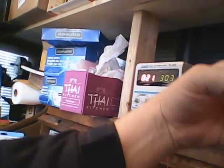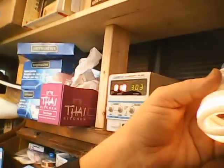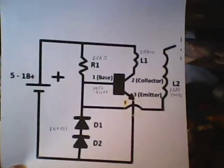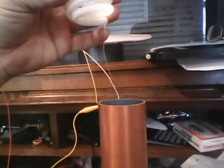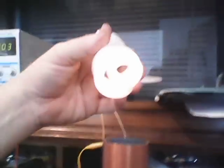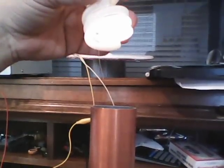What I'm looking at is how much output power is drawn compared with the input, and there's not much change to get that lighting up. We'll make some measurements and figure out the output power. I'd like to get the minimum operating power down — I can change the circuit somewhat and cut it down further. This is running at very low power compared to some I've seen, about half a watt, and it lights up the fluorescent bulb very well. Happy experimenting — we'll try to measure power and energy as we go along. Thanks, cheers!